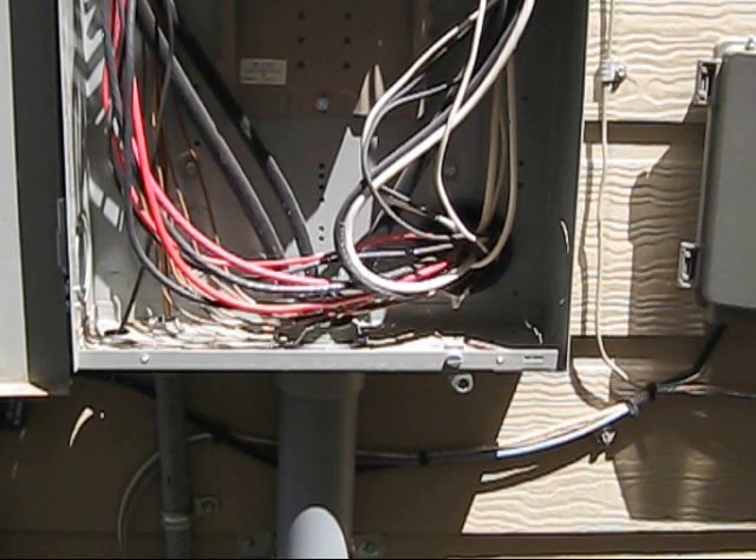You don't want to overload your system, but a 40 or 60 amp — you could just do a 30 amp really — but you probably should do a 60 amp. Then you would take one of your 30 amps out, change it for a 60, bring that down, run it through the conduit at the bottom, hook your box to the wall. The box on the wall would have — you'd want to get a box that has — it's like a sub panel.